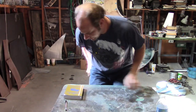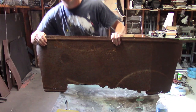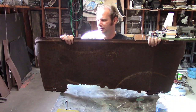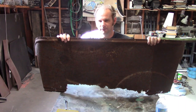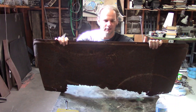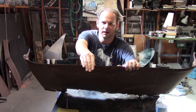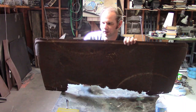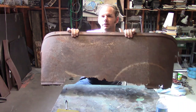A few other things. Like this — this is a front seat backrest panel. It's for an earlier body, like a 13 or 14. Hence the marking '1914' that he put on it. Obviously it's got some really bad rust damage, but I just bought this to use as a pattern. Now, on these earlier bodies, this edge up here, as you can see, it doesn't have a tab on it — it points to the outside. That was added later, like 1915 or 16. The early ones are like this, or at least some of them are. So that's why I grabbed this one — it looked like an early one.